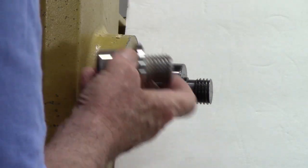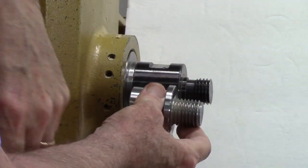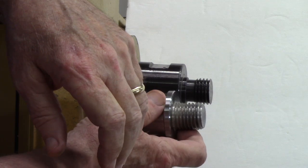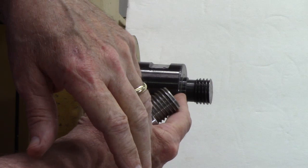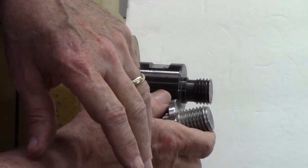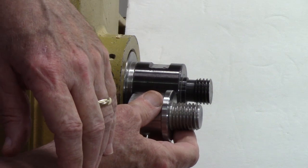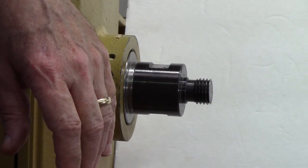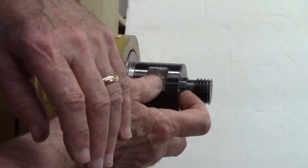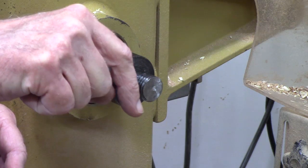Is there a difference between using a spindle adapter and changing out the insert? Yes — the biggest difference is that a spindle adapter pushes the chuck further away from the headstock, which can worsen or add a run-out problem. Generally, chuck inserts made by the manufacturer are going to have the most accuracy and keep the chuck closer to the headstock. That said, it doesn't mean you'll always have a problem, and a spindle adapter is an easy way to occasionally use a different size chuck. I hope this has been useful — please give it a like and share your comments. Y'all stay safe!